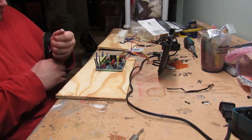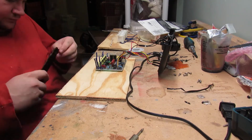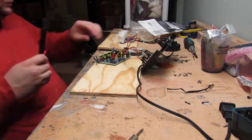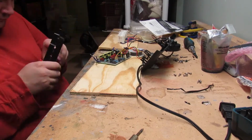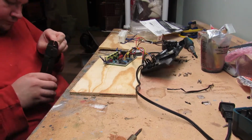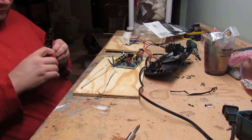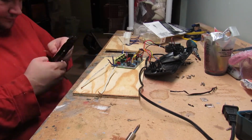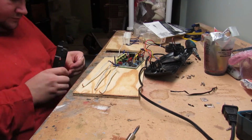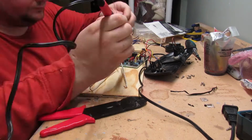And here's the thing about electrical wire that from what I understand, I'm sure there's somebody who's an electrical engineer going to see something and go, Rich, you're a freaking putz. But I found that if you want to splice a wire, you can use a wider grade of wire to the thing you're adding, and it'll be fine. But if you go with a narrower gauge of wire, it can cause problems. You want to try to get equal if you can to the sections you're splicing.